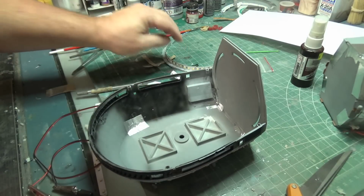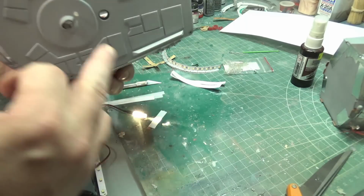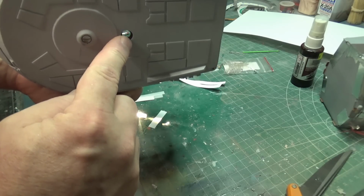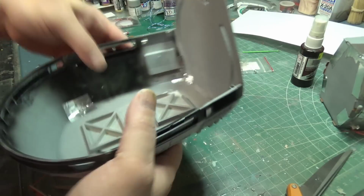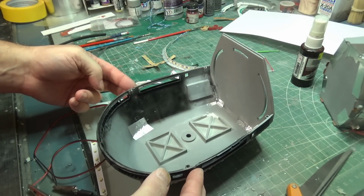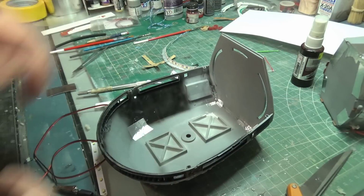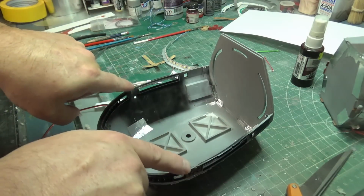And then that's everything, believe it or not. I'm not going to put a strobe down here because even though there is one and it would sit about there, it's right where the post would come out. So there's no sense putting a strobe there. What I am going to do is I have to light up these blinkies here on the sides. And I have to get those, at least get the wiring in place for them. I'm going to hook up Ralph's circuit to do the actual work on that, to do the blinks and the strobe.